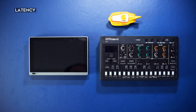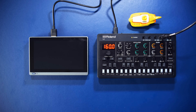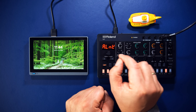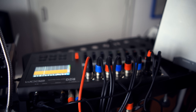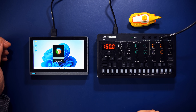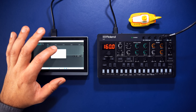Let's get the most important question out of the way first: how's the latency? Latency is the time between sound entering the system and leaving it again — we want this to be as low as possible to avoid a disconnected feeling when playing music. Here's my test setup: on the left side there's the mini PC and on the right side a Roland S1 synthesizer. I'll record one side of the S1's stereo output directly to my Zoom R20 audio recorder, and the other side will go through the PC and then to the R20. I'll open the resulting recording in Audacity, zoom in, and measure the time difference. In the first test, I'll use the S1's sound-over-USB feature and the Windows Wave Out audio driver with default settings.